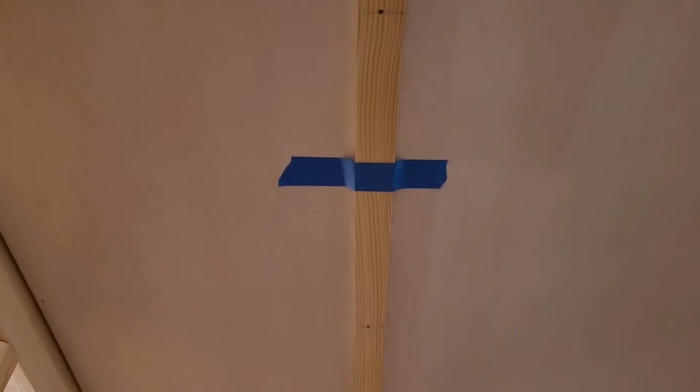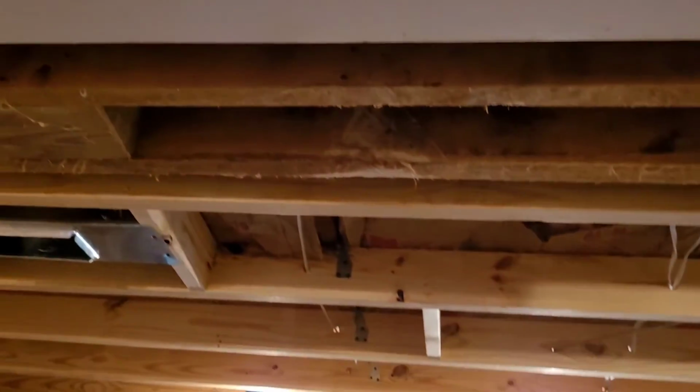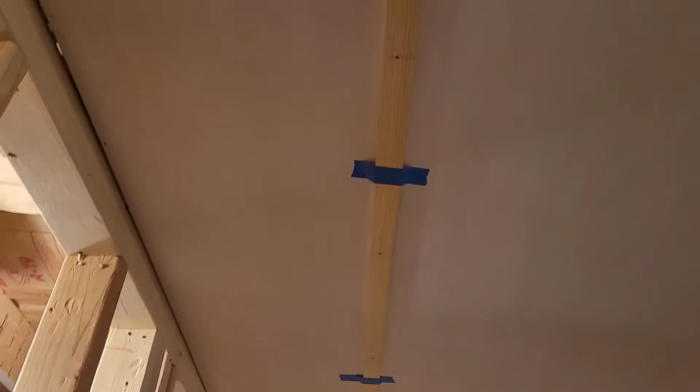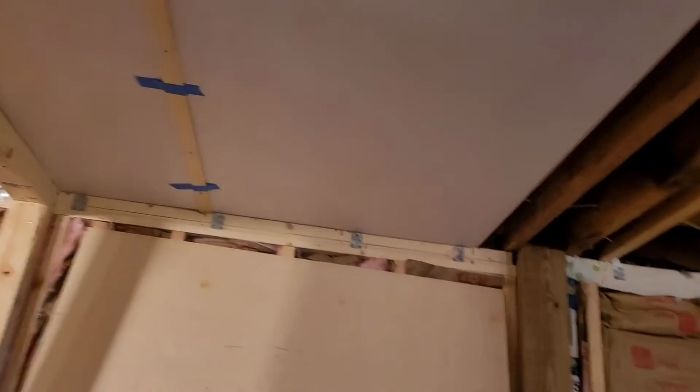And I did that so that when this is all done and the whole ceiling is covered, those screws, theoretically, from that hole right there where there will be a screw, should be a straight line, kind of like a grid every 16 inches to keep the hardware even across. And then up in the edges, it's just stapled in place to support the weight on that end and on that end. Once everything gets together, there'll be trim, like a crown molding across the top there. And then where each panel meets the next, so there'll be another panel here, right where that meets, there'll be a piece of trim to cover the seam.